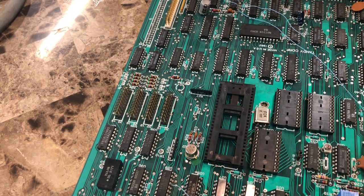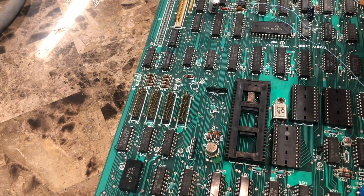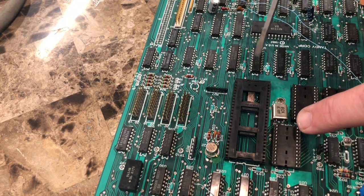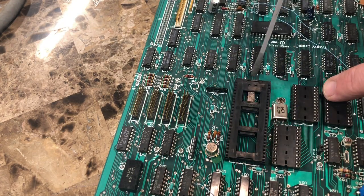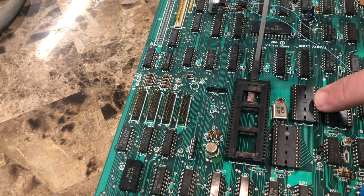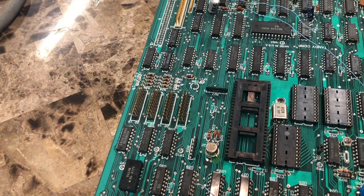I suppose there's some other people that have seen this, but I haven't. So, hey, maybe you haven't either. But look at this. Here's what happens. It's spring-loaded. You put the chip on top, and then, see this? It springs back. So you put the chip in, I do this, and the chip will drop down into the socket, and then when I let go, it's grabbed all the legs.